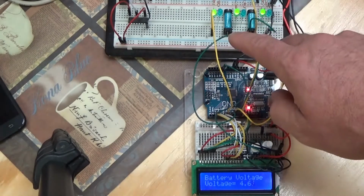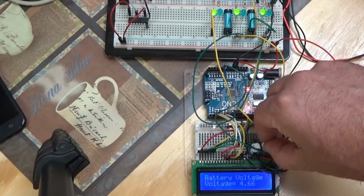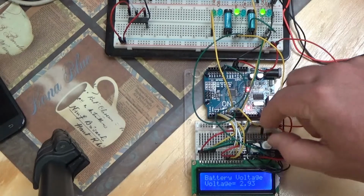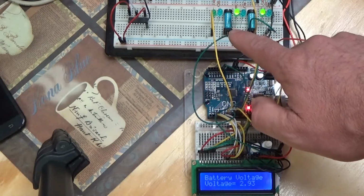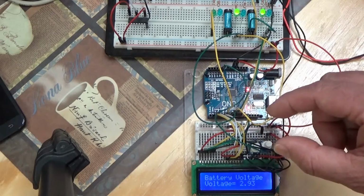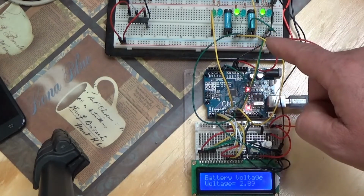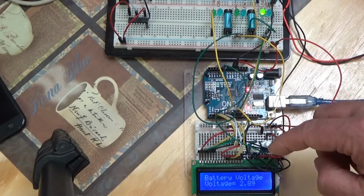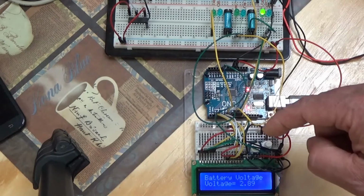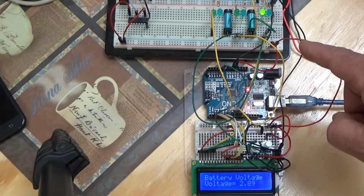I turn the voltage up high, sun rising. Now a cloud is passing by. Oops, turn the voltage down, past the threshold. One goes off, then there's a 10-second delay, which is going to be a 2-minute delay in the real world. And then the other one's going to go off, and the cloud is still over, where our voltage is dropping, the batteries are sinking. So we want to shut off that third rig too after we check the voltage.